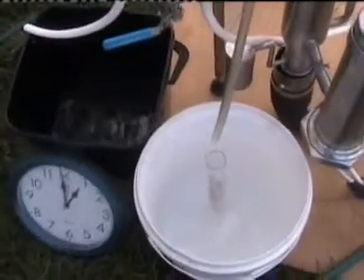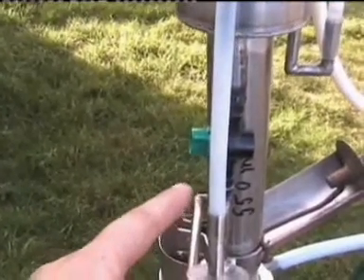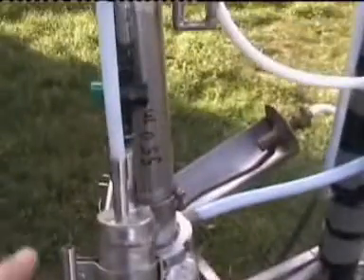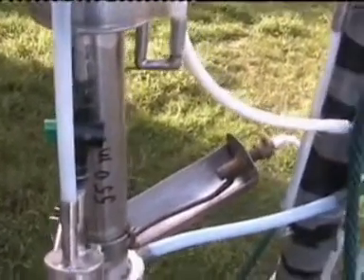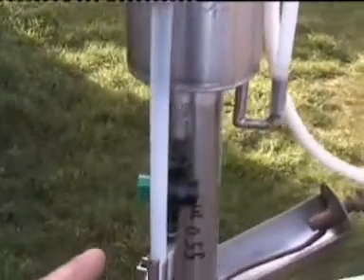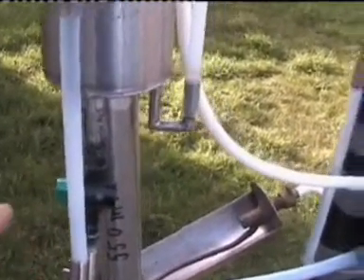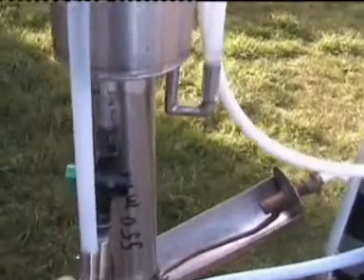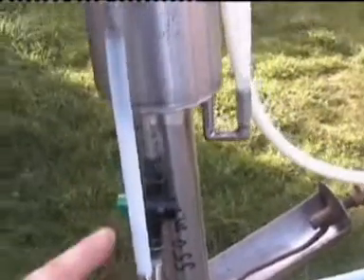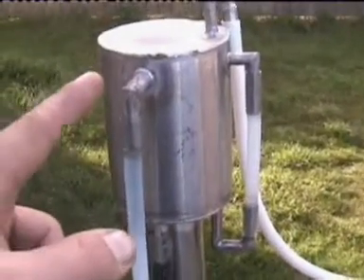After adjustment, you're not going to get your spirit straight away. I would recommend that when you start your distillation, just keep this valve closed completely for at least 5 minutes before you open it up and adjust the spirit flow. Because if you keep it open, you've got all the fractions coming out of the still — water and everything else — which reduces the percentage of the spirit. By keeping it closed, you're actually forcing the spirits to form a kind of queue inside the column, so the heaviest ones stay at the bottom and only the lightest fractions reach the top of the tower.